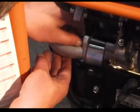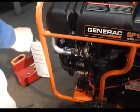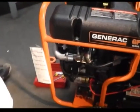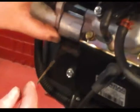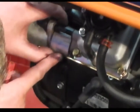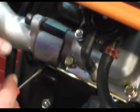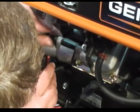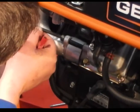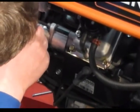I'll pull this in here a little bit and show you — you want to leave that a little bit loose so you can move it. With a smaller screwdriver, we're going to lift that adapter spacer up so we can bring that bottom one in a little. The reason we use this spacer is because this isn't exactly set perfect — you can adjust it a little bit. Just get a screwdriver in and pull it up to line that gasket up. The gasket they use is pretty thick, but this one here is a little bit thinner, so I'll just bring this adapter up and lock that down a little bit on this top side. Hold that spacer up and you can kind of see it move up a little bit — that definitely does make it easier.